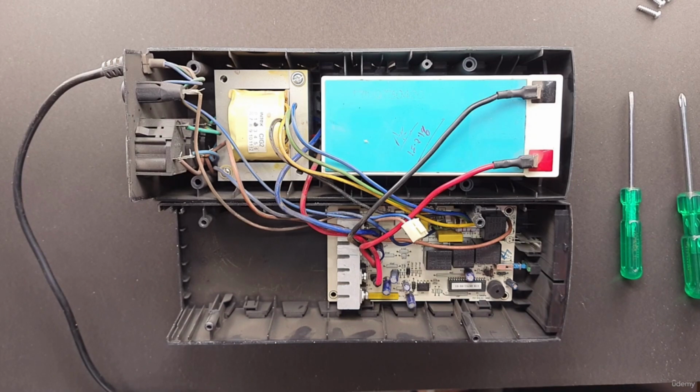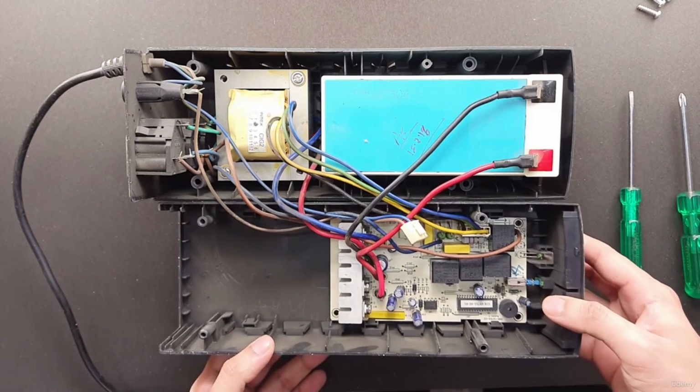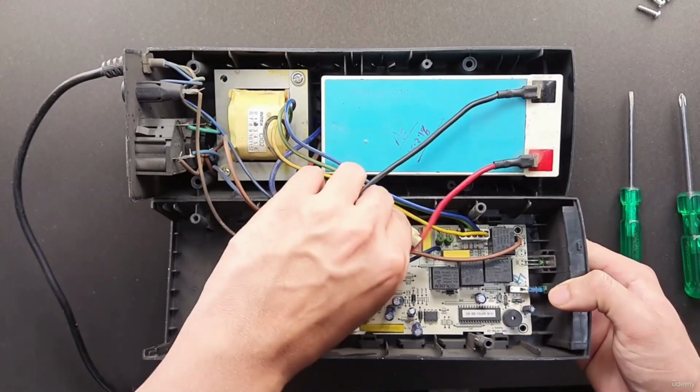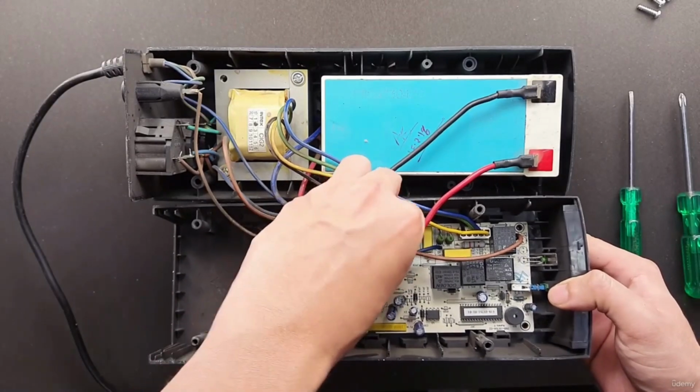Maybe the wire needs to be kept away from a hot heat sink that could melt, or perhaps a cable carries a weak delicate signal that would receive interference if it got too close to some other elements of the machine. Or maybe the reverse is true. Sometimes wires carrying high voltages may need to be kept away from the other circuitry to avoid not only interference but also the possibility of arcing. So to begin reassembly, we can connect the connector back into its original place.